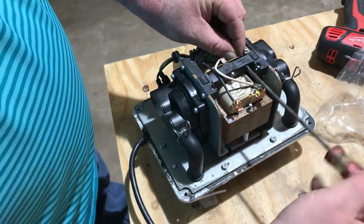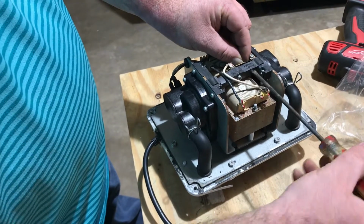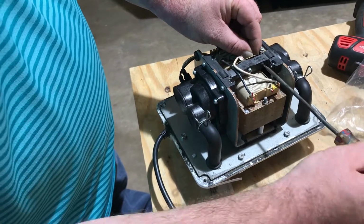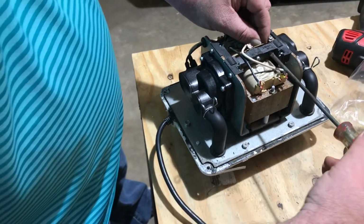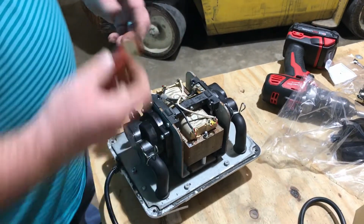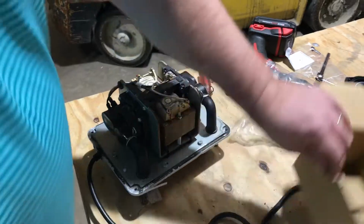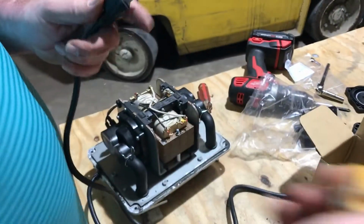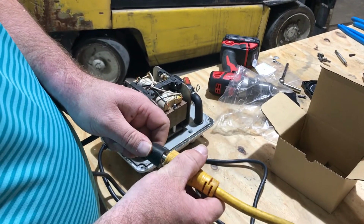So you put that safety screw in, and that nylon nut is not the easiest thing to do. I even struggle with it sometimes putting it on there. There's 2 sets of threads. You don't need to get the second set of threads on there. There's a little gap in there. Once this is on, you're good. So it's good to go. What we're going to do before you put it all back together is you're going to test it. We've already pigtailed it. Most of the Clearstreams are hardwired.